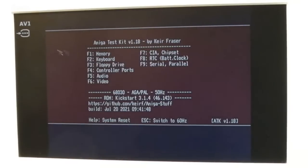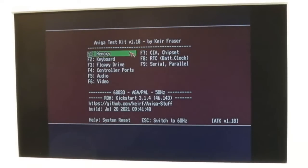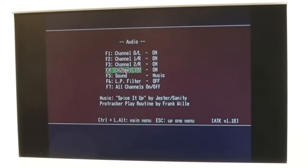Right, so here we are, booted back up with that capacitor replaced. There's no short on that rail. Haven't measured it, but there's no reason why it shouldn't work unless the chip is faulty. Hey, sorted. That's all it was. Much, much, much louder now.